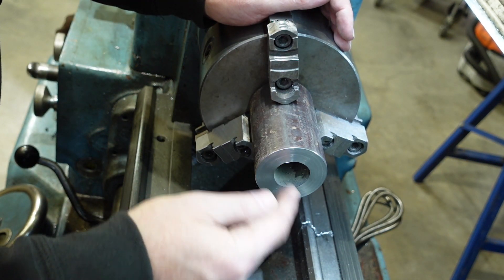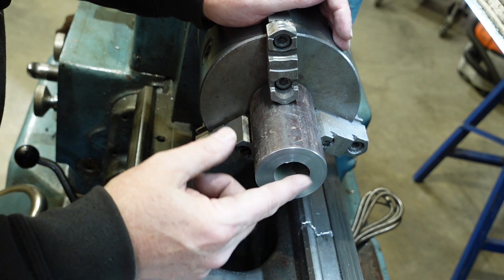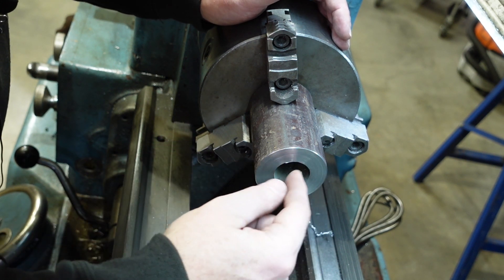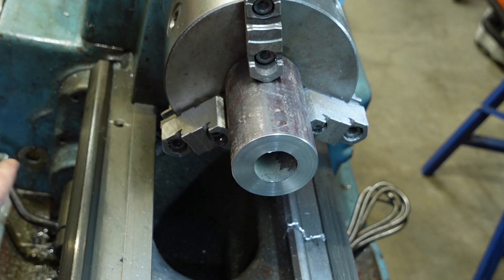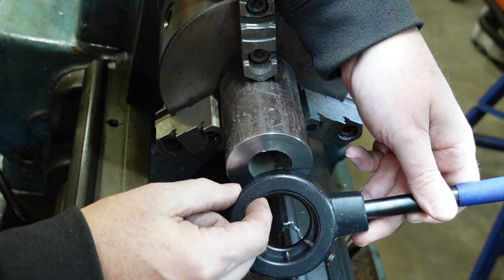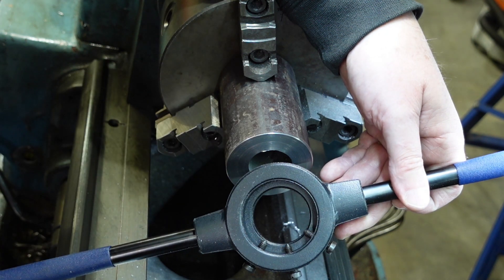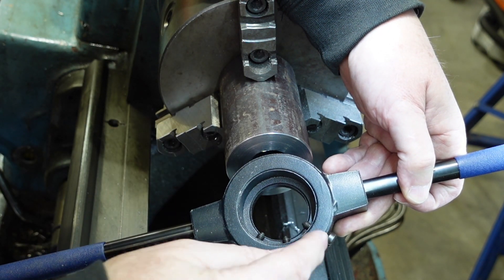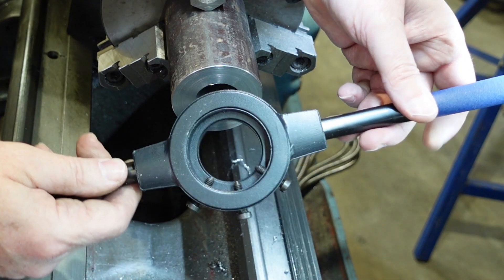You can see the bore wobble around. On both ends I'm going to be counter-boring that, so it's not going to worry me too much - but it also means that for work-holding purposes I can't just put a center in there and support it that way. This is a little bit thin: looking at the die holder I've got for this size die, there's a decent bit of meat there for the screw to go in, and so this could be a little thin. I might have to heat-shrink something on there, because the torque on the die is held entirely by those screws and you need a decent anchor for them.